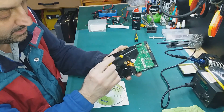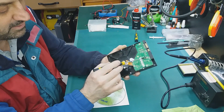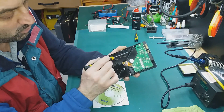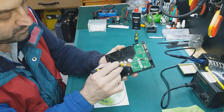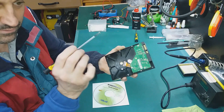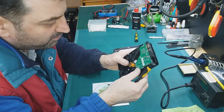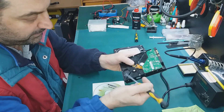Sometimes a PCB is made such that it doesn't use a direct ground — the ground is connected over the case. So if you remove this screw you might not have a ground on the full electronics. That's something that sometimes in electronics is done like that, but I don't think it's the case here.